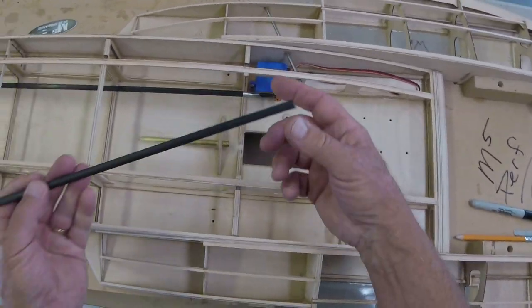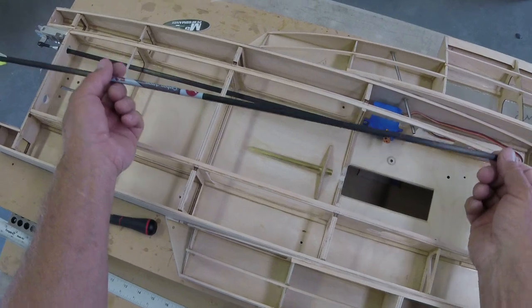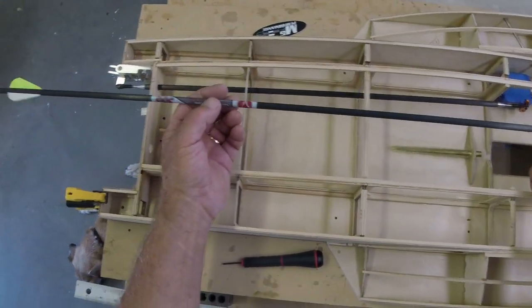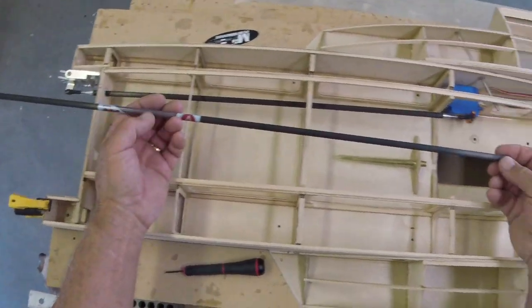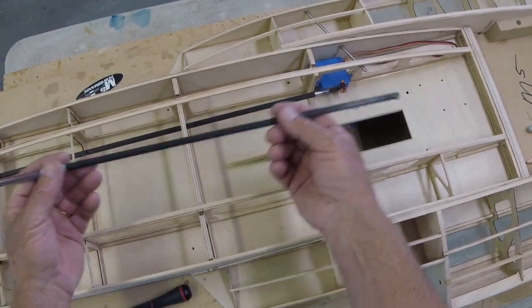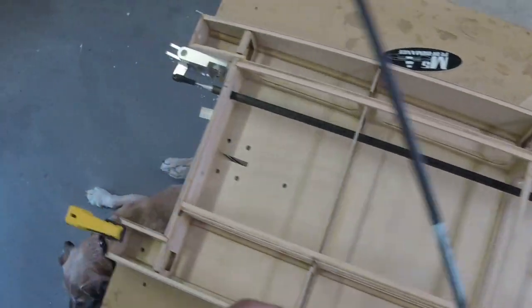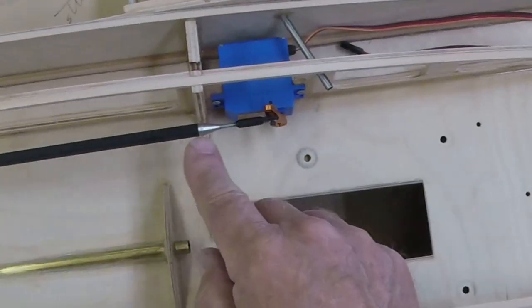And there's a company called Zip Kits. They actually make an entire kit. It's spelled the way it sounds, Zippkits. You can find them online. They sell a lot of gas boat stuff, but they have a steering linkage kit that I believe comes with the carbon shaft, and with these cool little aluminum ends through which you put your 440 rod. I think it's 440. Yeah, 440 rod.